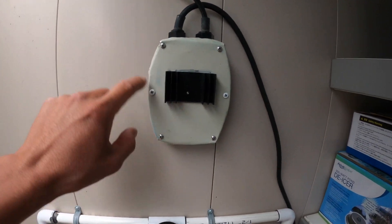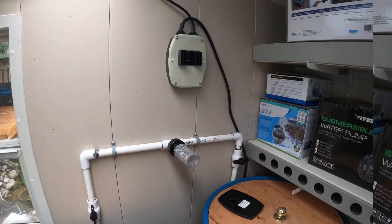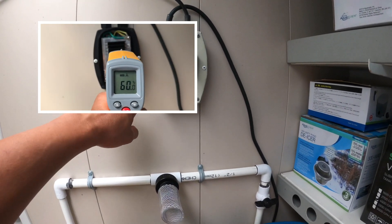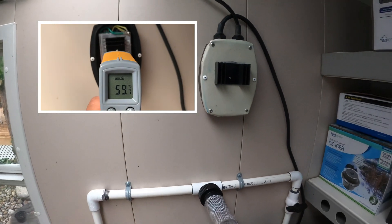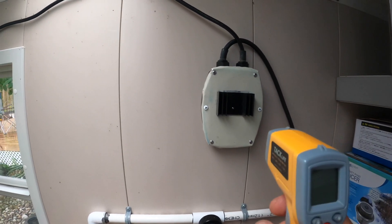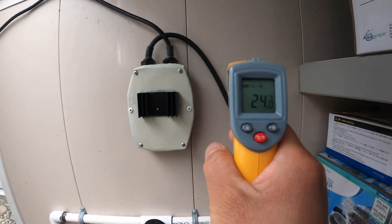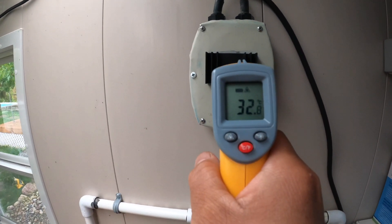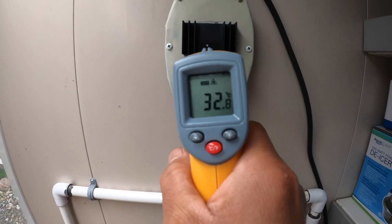This is my finished modification and it's been running over a week now without tripping the GFCI outlet. Two days ago the temperature outside was at 32 degrees Celsius, and this unit was running at 60 degrees with my initial modification without this aluminum cover. Today outside temperature is at 20 degrees Celsius — room temperature is 24 — and this unit is running at 32 degrees with the heat sink, compared to 52 degrees before.